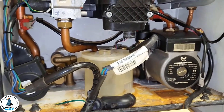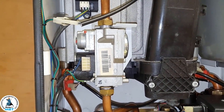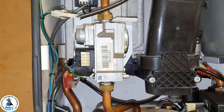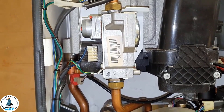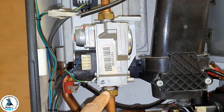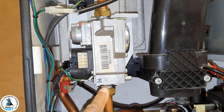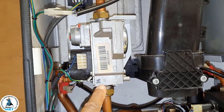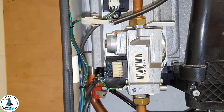The gas valve itself can also give an L2 fault — is that mainly through a faulty solenoid, or can the gas valve actually be blocked inside as well? Yes, that can happen. Turn the gas off at the inlet, remove the gas valve top and bottom and at the inlet. You can get particles built up inside the mesh of the gas valve — if that happens, get a hoover and clean it out. If it's clear, then you can have a fault on the gas valve itself.